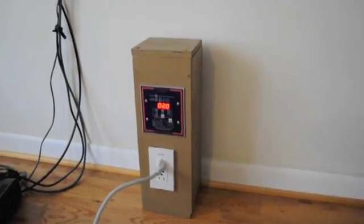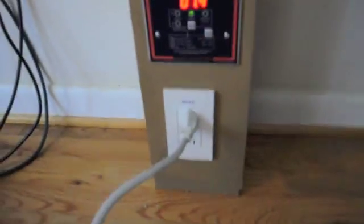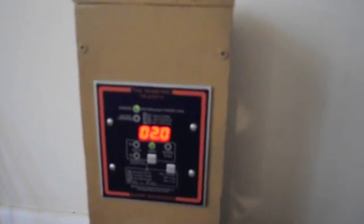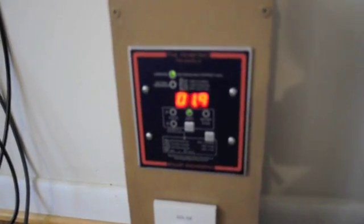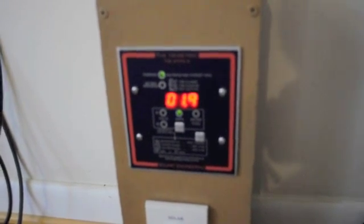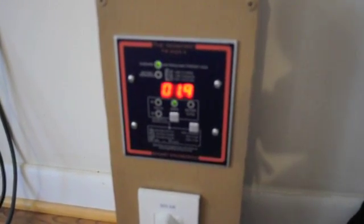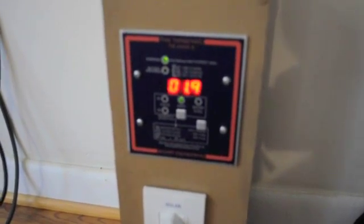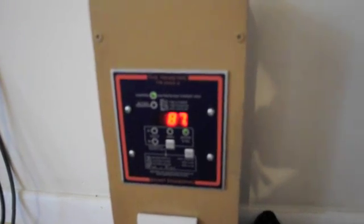Here is the little box I built for the living room so I wouldn't have to cut a hole in the wall. The Trimetric comes in through the wall into this box. Right now it's telling me how many amps are going into the batteries, including what I'm pulling out. I'm getting about 6 amps in from the panels but using about 4, so I've got 1.9 amps surplus going into the batteries. It also tells me I'm 87 percent charged — 13 percent from being full.